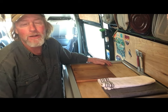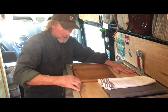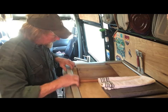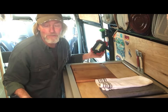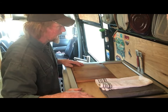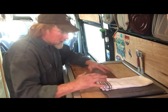When I build out the galley — which is not done yet, I still have to put cabinets or drawers underneath — this is the refrigerator/freezer area, then the stove area, then the sink area over there. The 80-20 provides a nice surface to put quarter-inch plywood in with a fitted fiddled edge, like most boats have, so if you're driving, stuff can't slide off. This higher countertop area is nice for writing or using a computer, and it's also nice to have a standard countertop height over here for cutting and cooking.